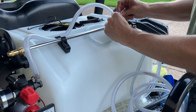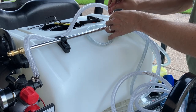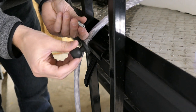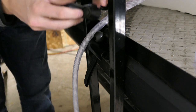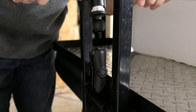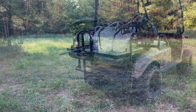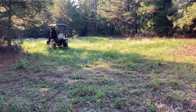The next step is just creating a connection point for that yak attack screwball. I use my golf cart for spraying my fields because they're not that big — you can use a tractor — but all I did was get another quarter-inch screw and another screwball to make a connection point for the one-inch screwball. This allows me to adjust it up and down, and then I just attach my boomless sprayer. You can get a 12-volt battery and, as you can see right here, I get about 12 feet of spray. I used this to manage all my food plots this year after seeding, and it worked great. I hope that helps y'all, thanks.